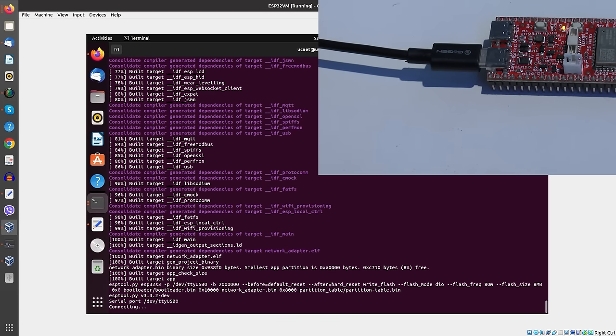It is a bit troublesome to use with this terminal and sometimes you get errors, but now for example we can go into the root directory and run ls — and we see that we are here on Linux. We can also run top to get the list of working jobs and the CPU load, and we can do a df command. This is basically a working Linux environment running literally on the ESP32 board. At this point we have got Linux running. Of course this is just the beginning — the next steps would be building a cross-compiler, creating an app, creating an image, and running all of it. The question of how useful it is in practice is a topic for another day.